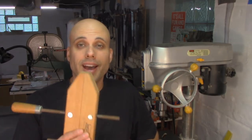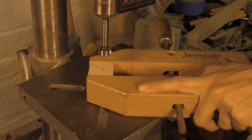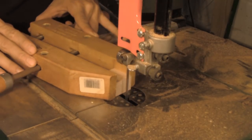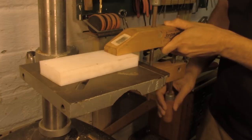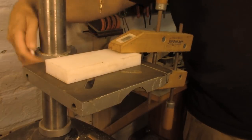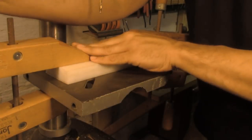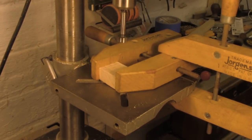If I have a larger piece that won't fit in a vise and isn't compatible with C-clamps, I use these woodworker's wood screw clamps. These are fantastic for the drill press and I don't see people using them very often. You can hold small parts in them and then just hold the clamp freehand while drilling. They also don't have to find a flat spot underneath the table — the flat jaws can grip the edge of the table and still do a great job of holding things down. These clamps also do an excellent job of holding onto each other, so you can grab a piece of work in one clamp, clamp that clamp down with another, and the whole thing is very rigid and stable.